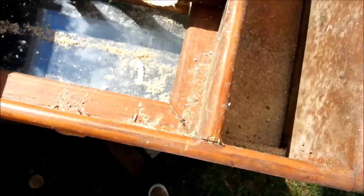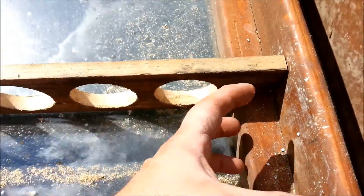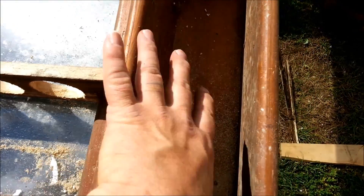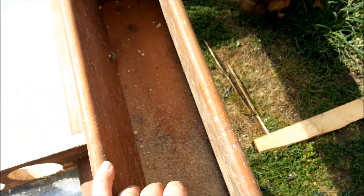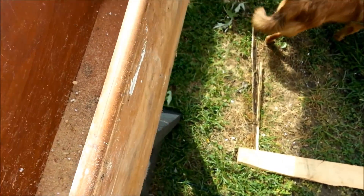This box has little cavities on both ends, and I'm going to take advantage of those. This is where my cool air is going to enter in — I'll drill a hole right here into this cavity. It'll all be painted black too so it contains the heat well, and it'll be sealed. Then out of the other cavity is where my ductwork comes out into the house.